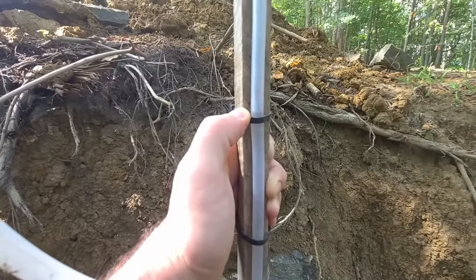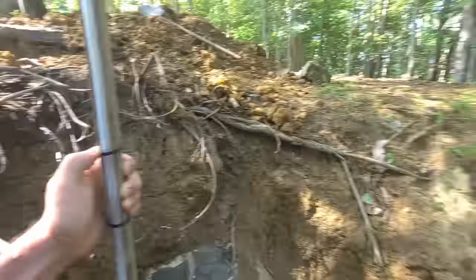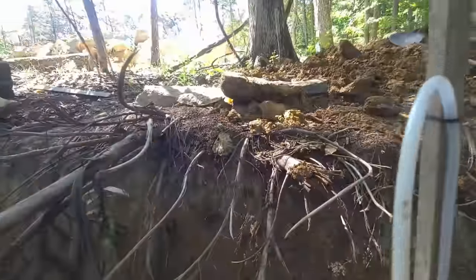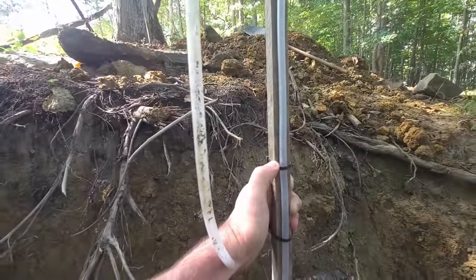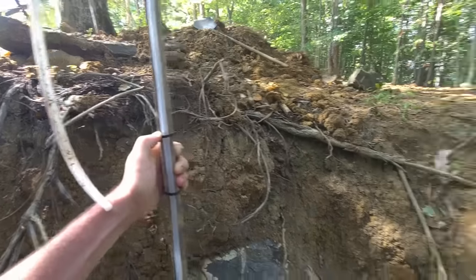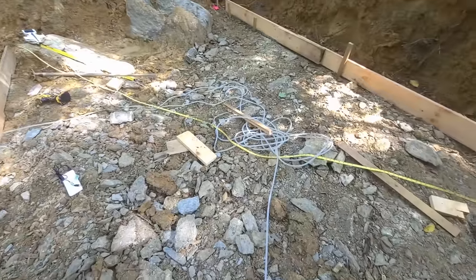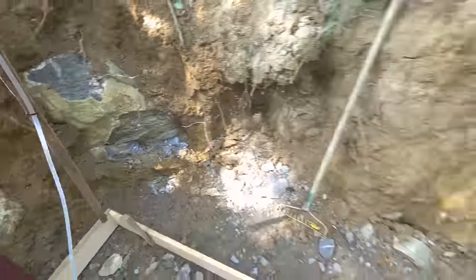The other nice thing about water levels is there's no obstructions. Like, even if your bucket is sitting there, and I got to make something level on the other side of that huge tree over there, and you're using a traditional laser, that laser is not going to be able to shoot through the tree to get a signal. But this, as long as you could reach with your tube, look, this tube is going down there all the way around in a squiggly spaghetti ball and then back up through here. So, all right, my corner's good there.